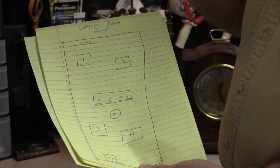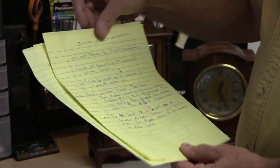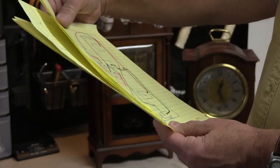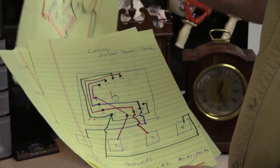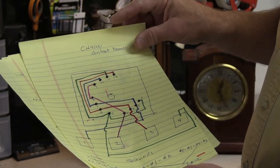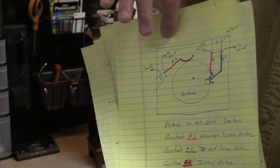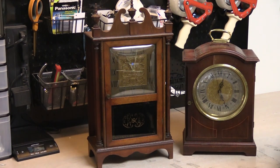There's one about how the clock mechanism works. Here's the basic layout of the chime base itself from the front. Here's a written description of what happens when the chime operates. Don't want to skip a page because they're in order. Here's a wiring diagram of how the components on the chime base are connected. And here's a wiring diagram of the switching contacts behind the motor. And here's a diagram of the rotor and switch contacts at the motor's drive. These were all of the beginning steps in understanding how these chimes work.